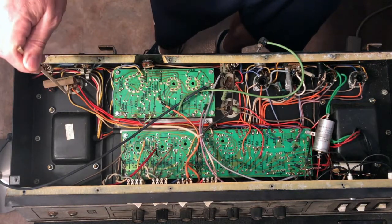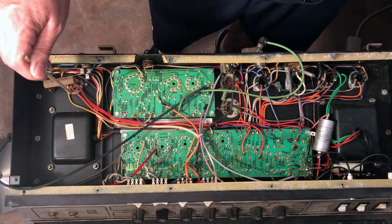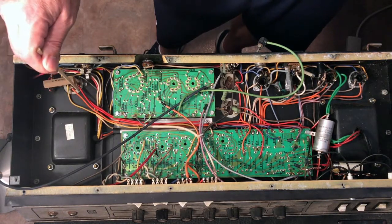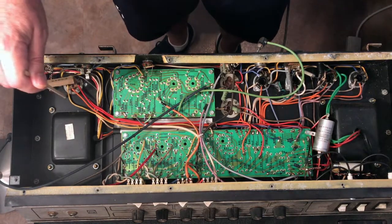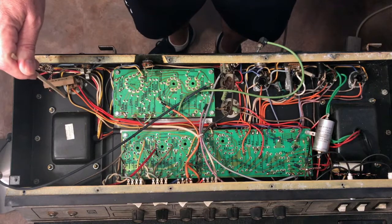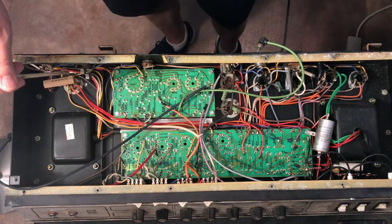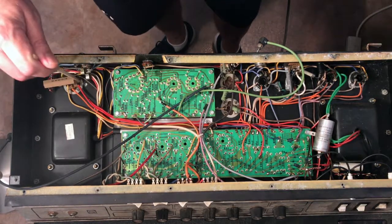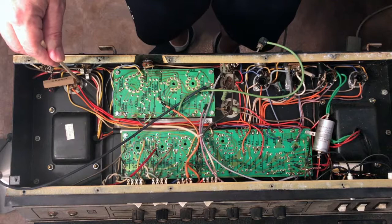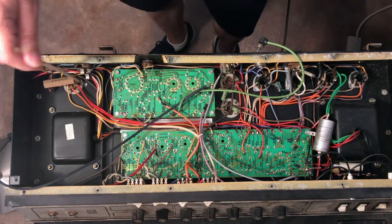You see there is some sort of fiber or phenolic board here, a spacer, that the capacitor can is attached to. So the ground lugs, typically that would be attached and somehow soldered or otherwise electrically connected to the chassis, or not. The line from the output jack, the ground line, goes to what is the common 0 reference volt or low reference volt, which would normally be to the chassis.